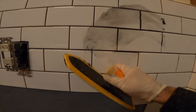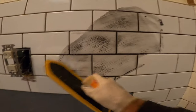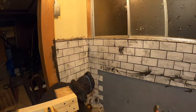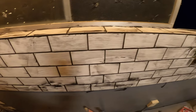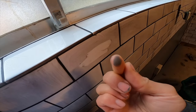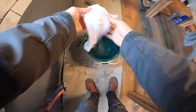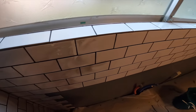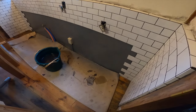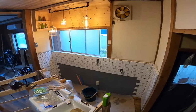I used a soft trowel to apply the grout to the walls — just squeeze it into every gap of the tiles. Once it's dry, wipe it down with a sponge and do a final cleanup with a cloth rag. You're going to have to change out your bucket water quite a bit to get the tiles clean and clear. I made a mess of my walls — the black grout stained them, but I have a plan to repaint the walls anyway, so it will be remedied later. Until then it's going to look a little stained — just ignore it.